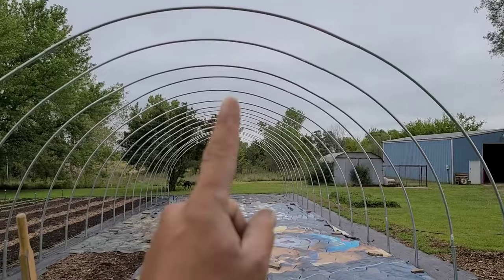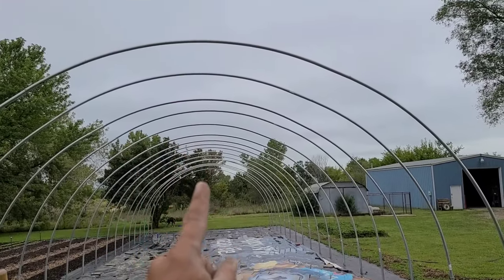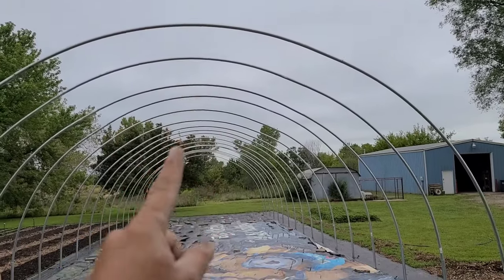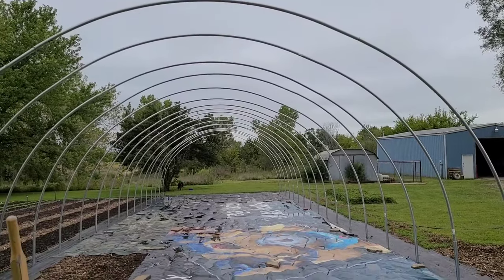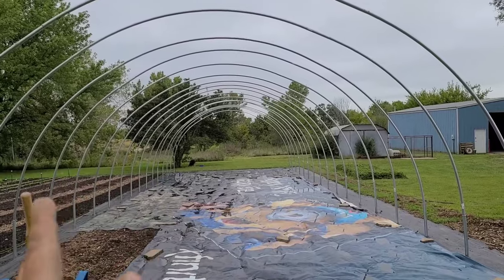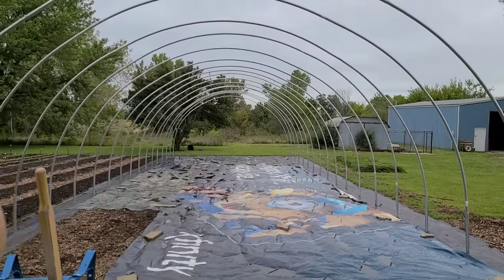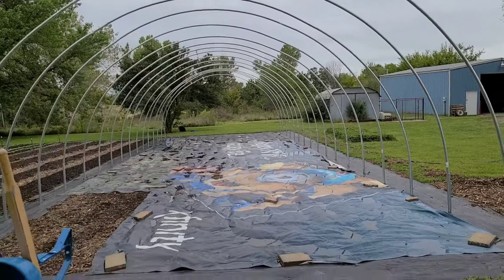What you've got to do is run a purlin, which is a center set of poles all the way down from the last pole to the last pole, and then you have braces that go in between that tie those together. And what you do is you put somebody on a ladder up here on the end looking up over the top, and then they have two people down below, and they either pick up on this side to scoot it this way or the opposite side, and then you have somebody in the middle tighten up the brackets as you go down the line.